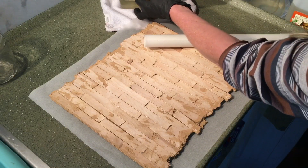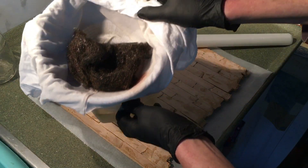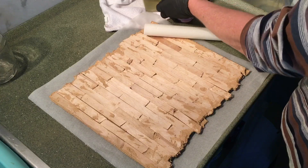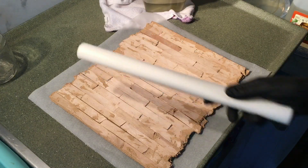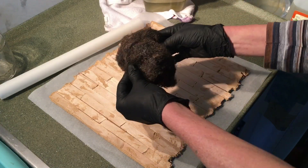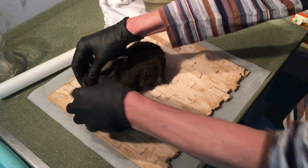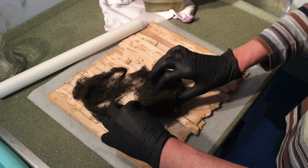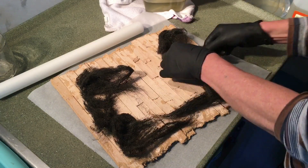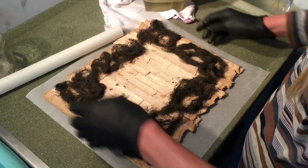The next day I took an old colander and some old t-shirt and I drained the solution with steel wool into an old bowl. I just took the steel wool and left the vinegar solution, put it back in the jar later. Put on gloves again - you can see it's all rusty - and then I'm tearing it up again. This is why it's easier to do it in the beginning. I spread it over the deck, but I really didn't have much - it's eating up all the iron - so I had to do this a couple of times. I advise you to take some extra when you make this solution.